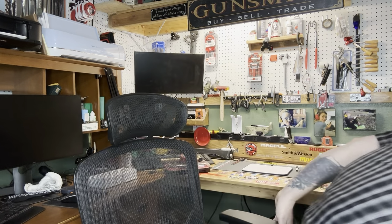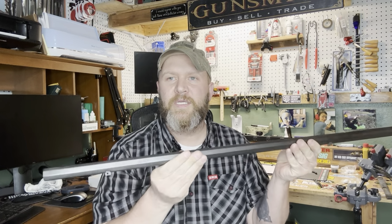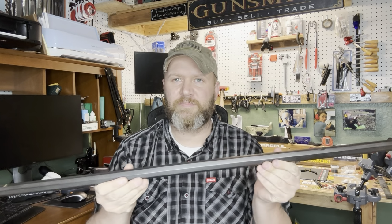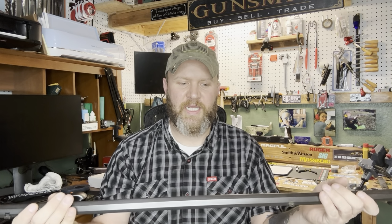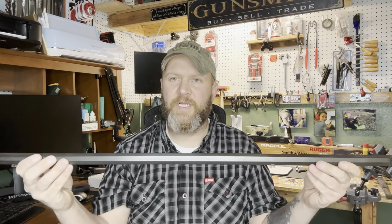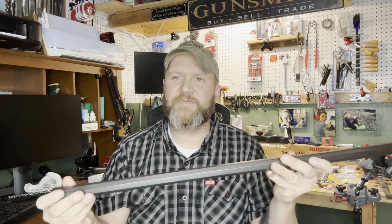This is the first time ever where I'm recording my intro after I've actually done the project. So this is the finished product of my barrel. As you can see, I was able to achieve a really, really nice, dark, deep bluing on this. And this was done entirely with hydrogen peroxide as the rusting agent and steam as the conversion process.